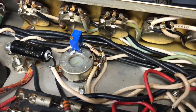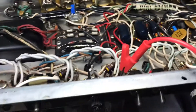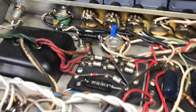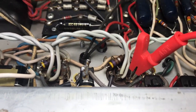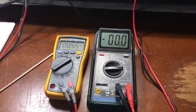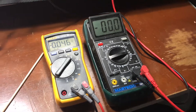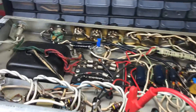I've just finished installing the bias potentiometer on top of the old balance pot. Before flipping this thing on at 120 volts, I'm going to ramp it up slowly with a Variac. The amp is plugged into a current limiter which feeds the Variac. All I'm looking for is negative voltage on the grids of the output tubes. I have leads connected to pin 5 — the control grids — with two separate multimeter wires for the inner and outer set of tubes. I don't want to red plate the tubes if I've done something incorrectly.